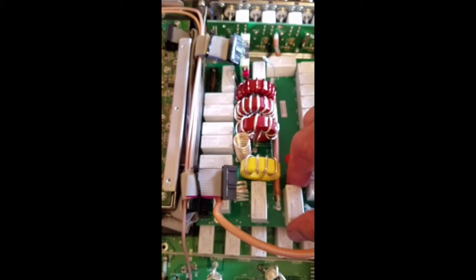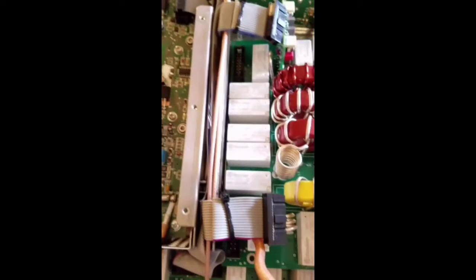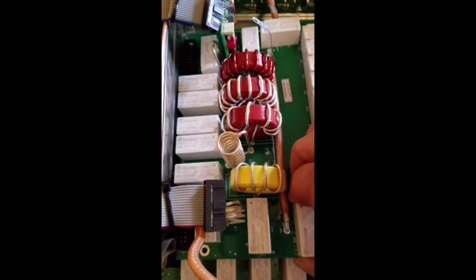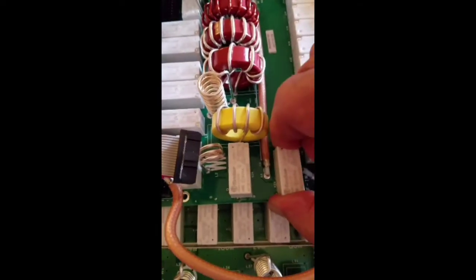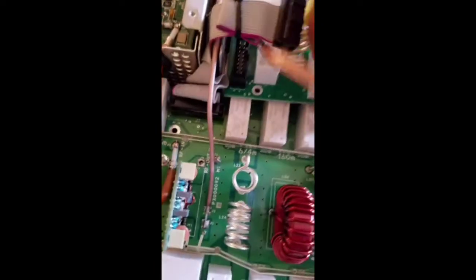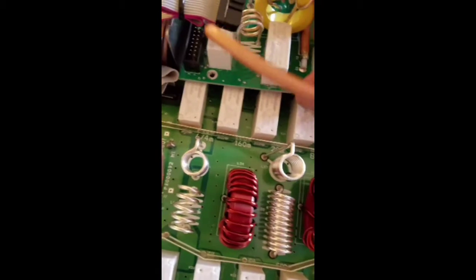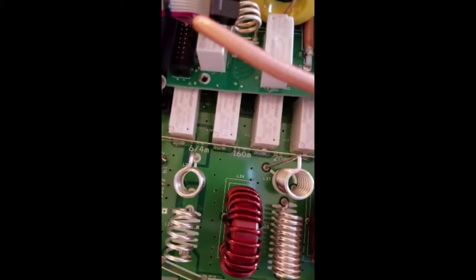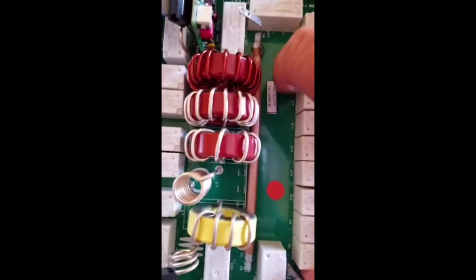The pad is in good shape and ready to receive the new coax. The new ATU board can really only go in one direction and is to be received by the main chassis. The easiest way to get it into position is to start toward the front of the chassis and then drop the board in so that the relays in back here clear and the cables clear. It's a bit of a tight fit, but that's one of the benefits of this amplifier — everything's fairly compact. It drops nicely into position, and then there are four screw holes ready to receive screws.